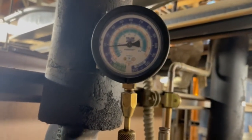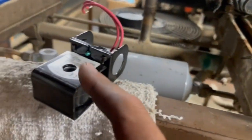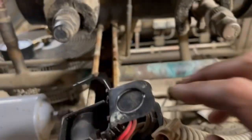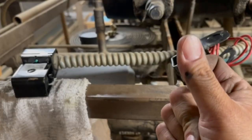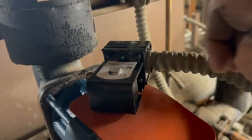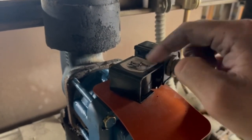I'll see where the suction pressure ends up - let me finish opening up both of these valves and then we'll double check our pressures. Here's my old solenoid and here's my new solenoid - I already punched out my hole and got my wires. I'm just going to take these off - always check to make sure there's no power - then swap this out.